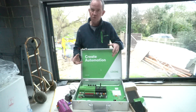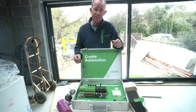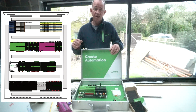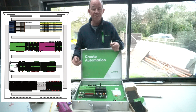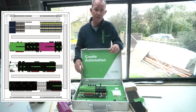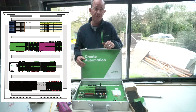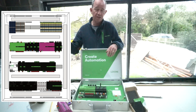There's a lot of things we can connect to and I'll be going through this in more detail as we finalise the design. The panel is going to be built off site. The green box in the diagram is the mini server, the purple box is the audio server, and the other black boxes are relay extensions — I think I've got two relay extensions to give me control of lighting, electric towel radiators, and other devices. I've also got another module going in to connect to my automated home and garage door. Hugh will build and wire up all of that panel off site and do some of the base programming. The first fixed wiring is all waiting — it'll just be a case of trimming and dressing those wires and connecting them into the terminal blocks.